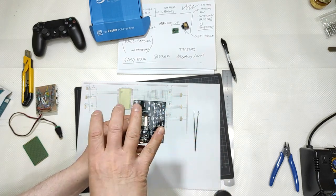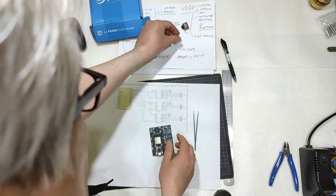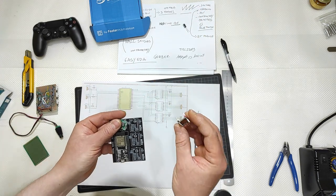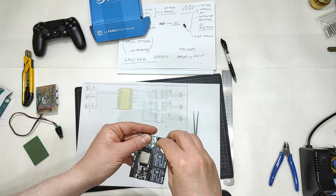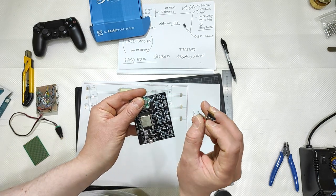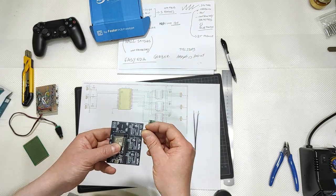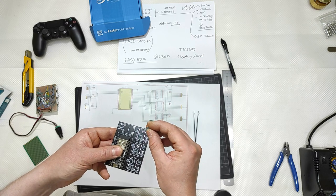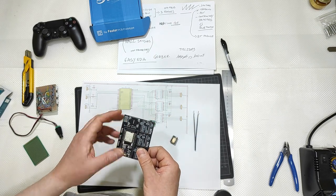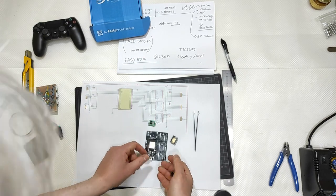You simply need to tell the dimension you want for the PCB, and the system will compact everything, and you will have it like that. And obviously this is in and out, with the exact dimensions needed for every component except this one, because it needs some foot there in order to get connected, because it also has those two pins on this side that once elevated will disappear. And also the capacitors, you simply push them inside the holes like that, and all you have to do is those solderings, very simple, one after the other, and nothing else, guys.